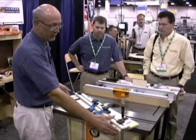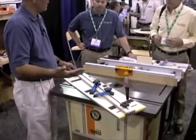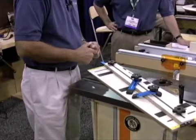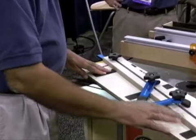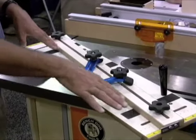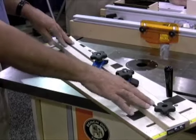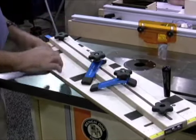It's a 32-inch platform with a 36-inch miter bar, so you have a four-inch extension for a lead-in when you first start your cut. We've added some self-adhesive abrasive strips, and those serve two functions: one is to hold the work piece solid on the jig, and it also helps secure the fence so it won't slip — it's really held in place.